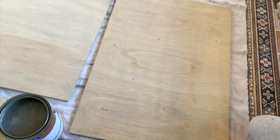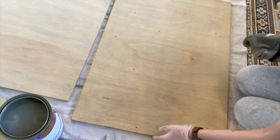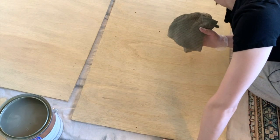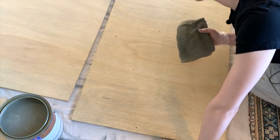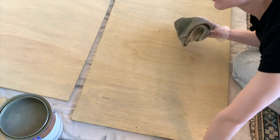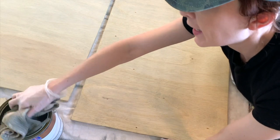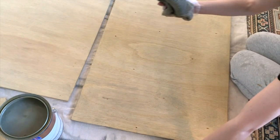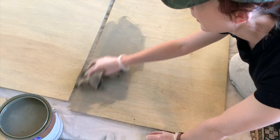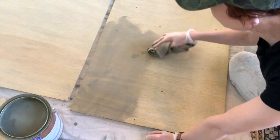I'm going around doing a second coat of stain after the initial coat because the initial is hardly visible. And as I've been doing this, I've realized that there is a correct way of doing it, as there is with most things. Anyway, let me show you how I applied the stain in order to get it to look its best. So I saturate my stain rag and then I rub it against the grain, get quite a bit on there.